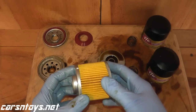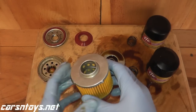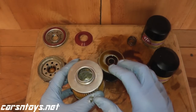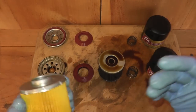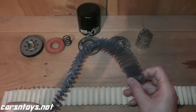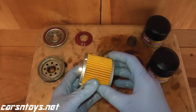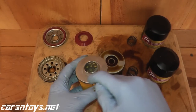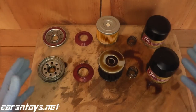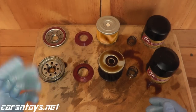I don't believe this filter is wire-backed. If you've seen our previous oil filter review videos, the higher-cost filters — your Amsoil, Wix XP, Royal Purple — are wire-backed. We will cut open the filter at a later time and take some measurements regarding square inches of surface area. But for now, let's go over what this looks like after 10,000 miles.